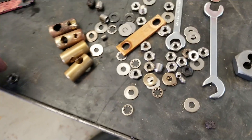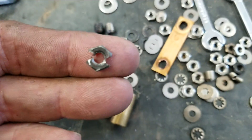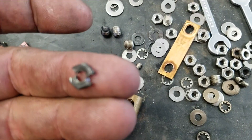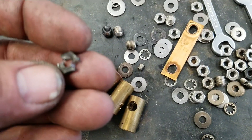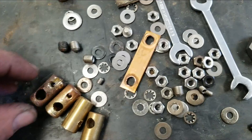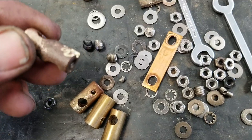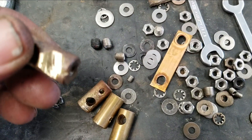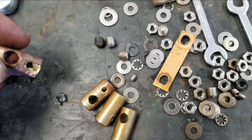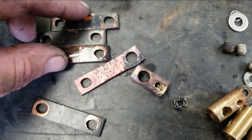Over on the bench — that's what victory looks like too. To get one of the nuts off I didn't want to shear off one of those studs, so we had to get in there with a little carbide burr and cut that nut out. Some of these didn't want to come off. You can see the discoloration. Got to get in there and cut out the side of it with a Dremel, relieve it, let it open up and relax.